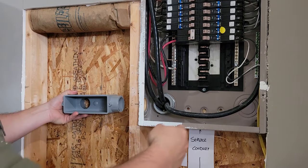And then I gotta put the 100 amp breaker in. That looks something like this. Two wires into the back. This is a CH panel, an Eaton CH type. A little bit better panel than what's over in the garage, but the one in the garage is a great panel as well. It's just a BR. It's okay to go from a CH to a BR for a subpanel.